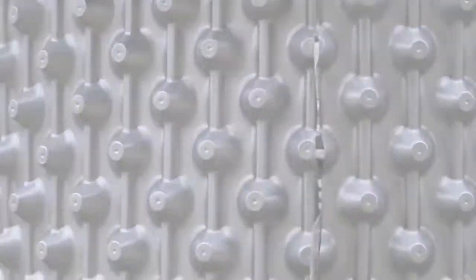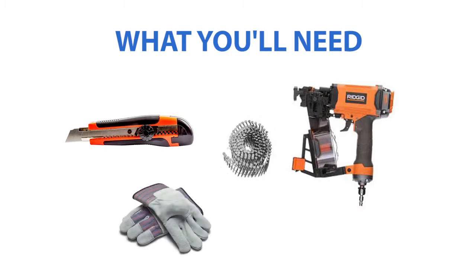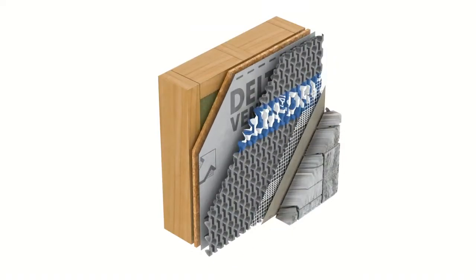Before you get started, you will need a few tools and accessories: utility knife or scissors, automated nailing gun or stapler, roofing nails 1.5 inch or corrosion-resistant staples with a 1-inch wide crown by 1 3/4 inch leg length. Wearing gloves is recommended. An approved water-resistive barrier must be installed as per local building code requirements prior to the installation of Delta Dry Lath. For ease of installation, work with 2 people.